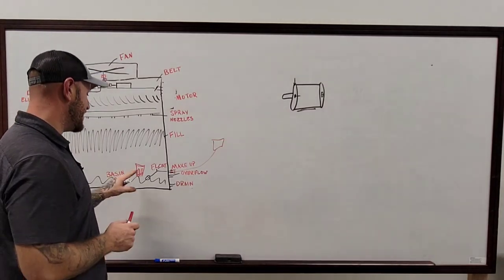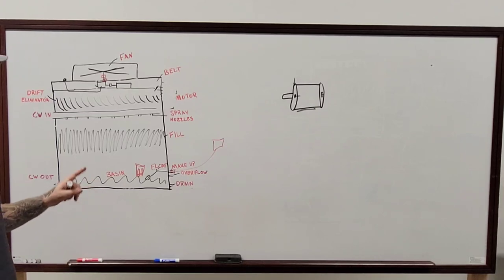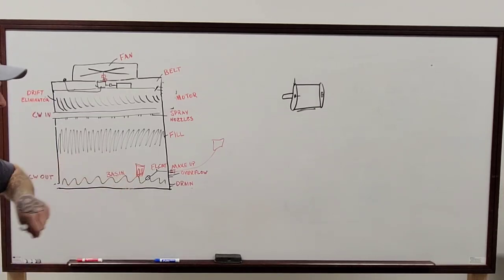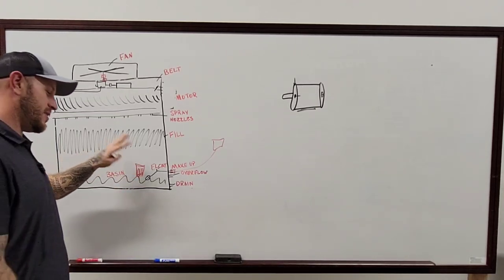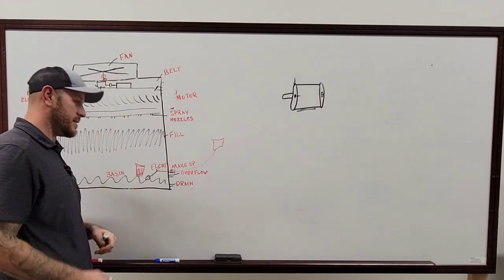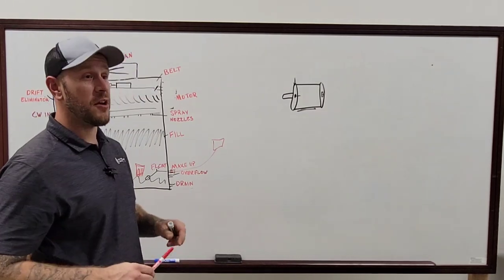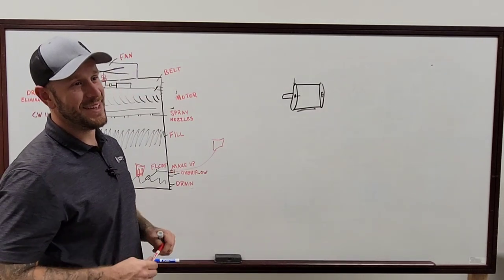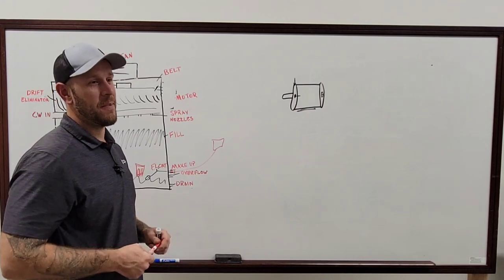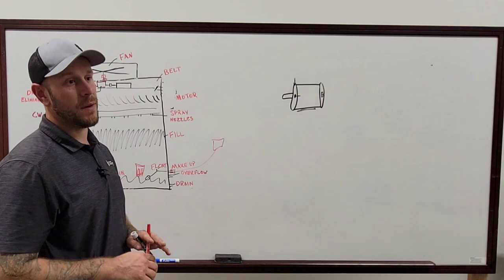If the rods are touching each other, or if they're touching the housing, whatever they're in, if they're touching anything other than the water, it will throw a signal to that controller to make that solenoid run all the time. And if you don't get down there and look, you're not going to find it. What you're saying is definitely don't bend them. Yes, don't bend them as you're putting them in. Definitely, that's a pretty important part.